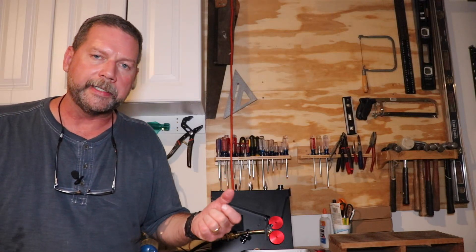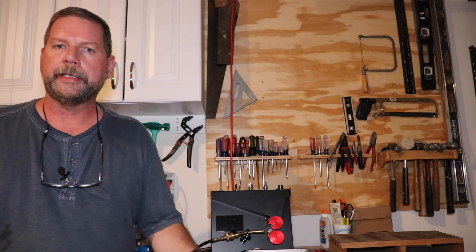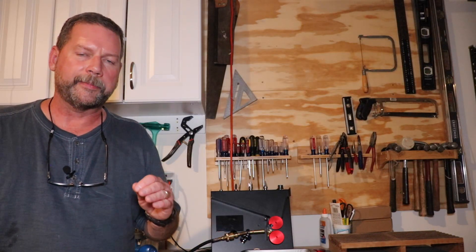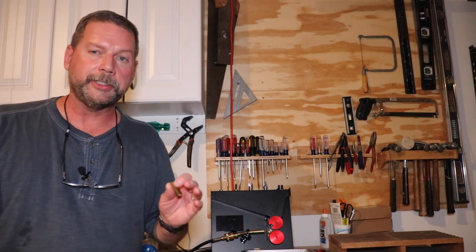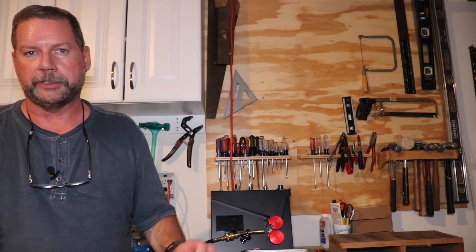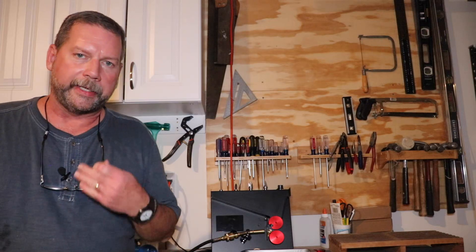That works fine except that after a few cases, that little dowel that fits up in the primer pocket gets burned, everything gets hot, and the casing starts falling off early. I could do it — maybe 20 rounds for the 50-90 Sharps, or a few rounds for the brass end of 12-gauge shotgun shells — but I never really reloaded very many black powder cartridges like 45 and 44-40 with an annealed case, just because it took me so long to do hundreds of them.